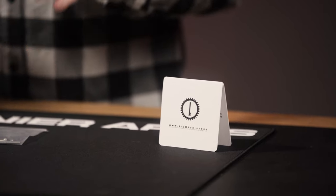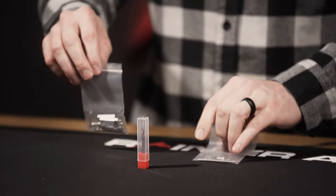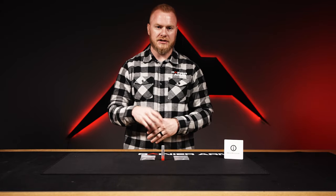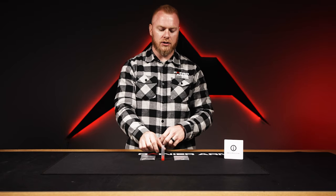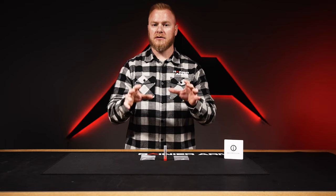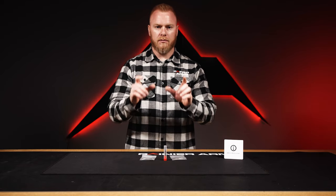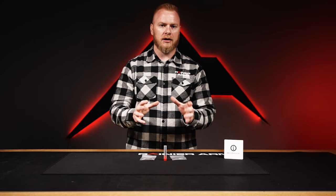The last product today comes from SIG, and it is the M Safety kit for the P320. It's a full toolkit that allows you to convert your non-manual safety SIG FCU into a manual safety FCU. Everything you need to do that is in this kit, including carbide bits for the cutting you need to do. You modify your FCU — it's pretty straightforward with the instructions — and the kit includes templates to help you find the perfect spot on your frame to cut out the section for the manual safety.